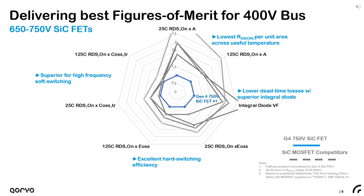For high-frequency soft switching, RDSon times COSS time-related is a good figure of merit, where conduction loss must be minimized while incurring short delay times with zero or low current turn-off. The RDSon times EOSS figure of merit, representing the minimal energy dissipated during each hard switching cycle, also shows the cascode FET as superior. Finally, the VF of the integral diode is nearly three to four times lower than a conventional MOSFET, helping to minimize dead time losses when used in a synchronous rectifier.